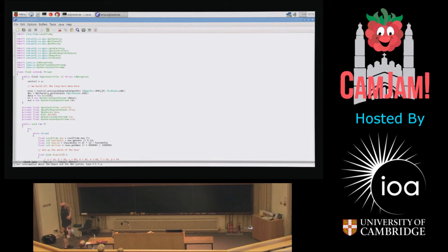What the store thing does is you feed all your data into it, and then you go, and display it. Because if you actually shifted all the data in, you'd see the whole screen flicker as it shifted round. So you shift it all in and go, bang, show it. You'll quite often see that in quite a few bits of graphical software. You'll see it create stuff, then do a go at the end. When it hits the go, it actually displays it. So that's what that pin does.